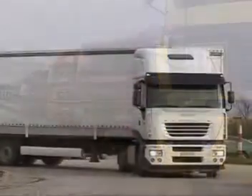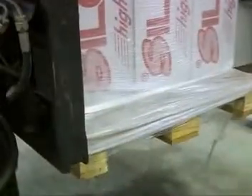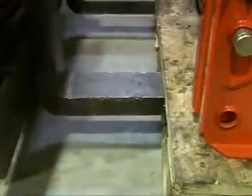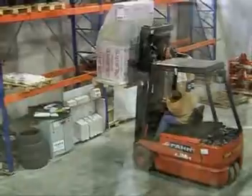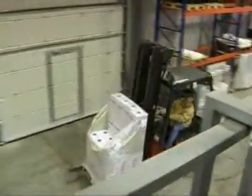Skidway System's calibration setup procedures are very simple and consist of a few steps to complete the automatic calibration of the empty forks and the known load weight being lifted just above the ground. At any point if you make a mistake for whatever reason, turn the power to the Skidway off and start all over. All calibration values will be automatically stored after the calibration setup procedure is finished.